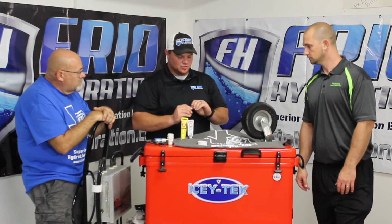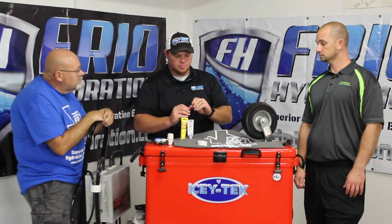This is something I learned from, once again, my dad, working on cars growing up, working on everything: get you some thread locker. There are two types, red and blue, and this is easily picked up at Walmart, Lowe's, O'Reilly's, AutoZone, and there's Loctite. They have the thread locker blue, thread locker red. Red is going to make it permanent, and it's going to be very hard to ever get that apart. So consider that. If it's something you want to stay there and you know you will not want it to ever come out, you can use the red.